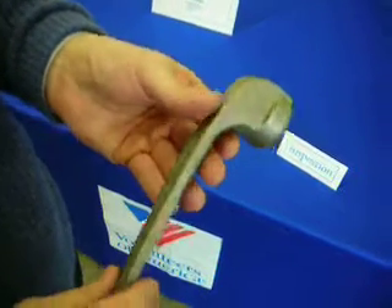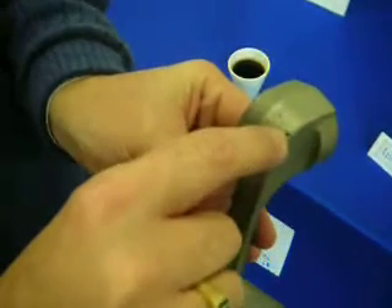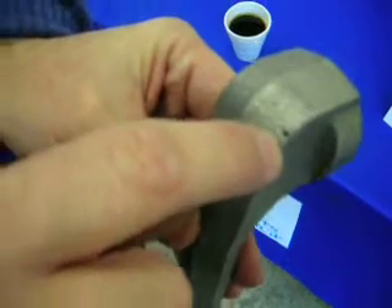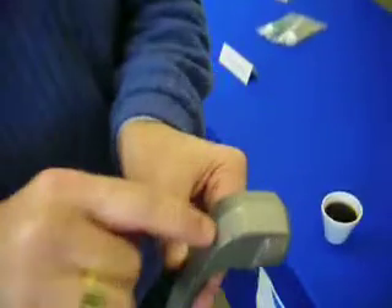What we were doing with these is a physical inspection of the part. And we have a spot right here — a little divot. You can't see the bottom of that. What that is, in the form of a casting, is something called porosity. And if you think of a spider's web, that little hole leads into a large spider web.